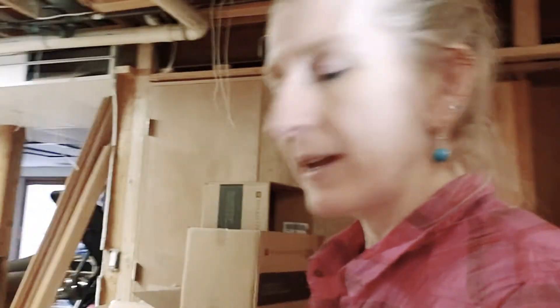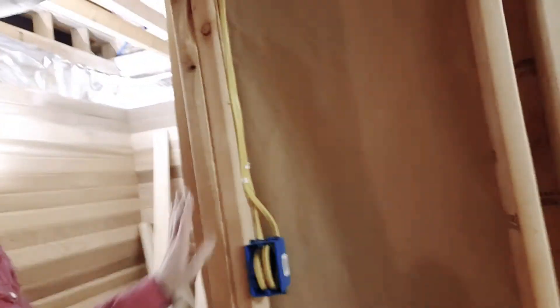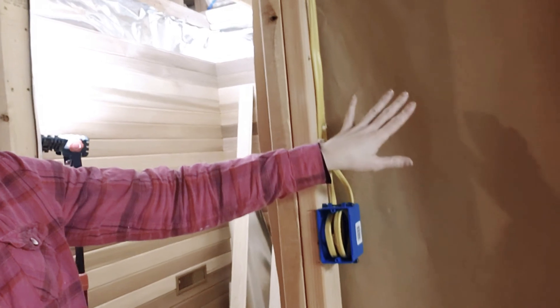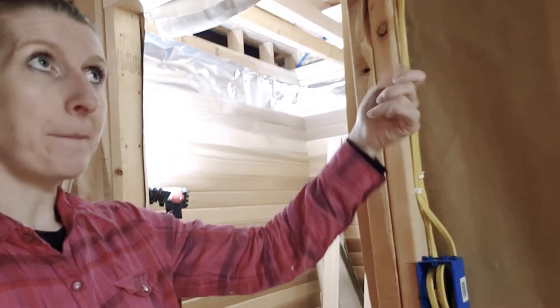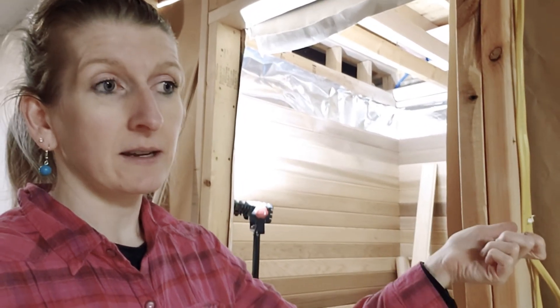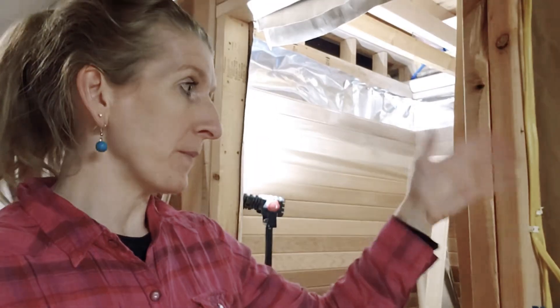What I'm going to end up doing is just outside the sauna door — here's going to be the switch for the light. Somewhere on this wall is going to be where the controls are for the actual sauna, and also on this wall I'm going to put a place to basically connect audio. Probably put a little shelf so you can leave your phone out here, out of the weather. You shouldn't be playing on your phone when you're trying to chillax in the sauna, right? So you can put your music on and plug it in through here. You've got to take the opportunity to run all that stuff before you start closing up ceilings, because it's just easier that way.